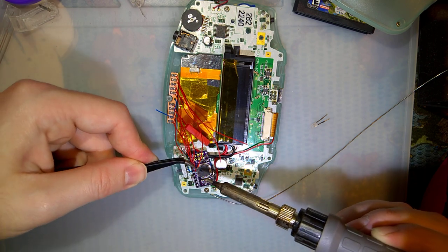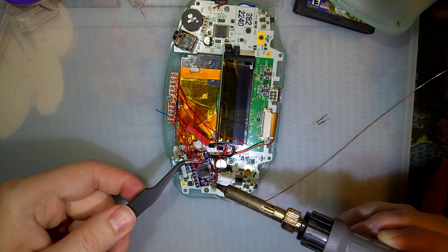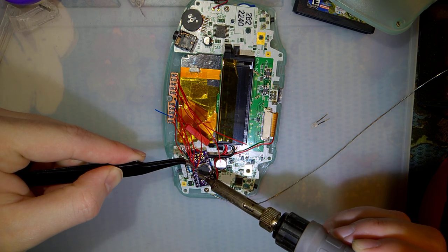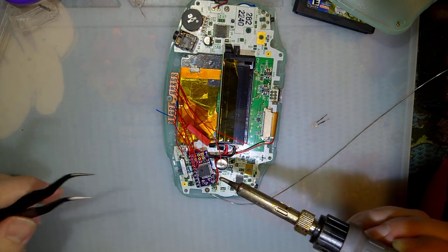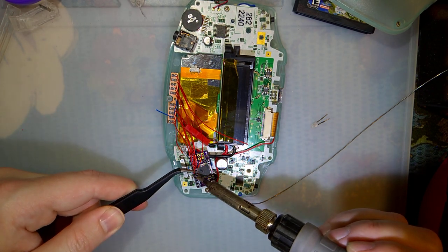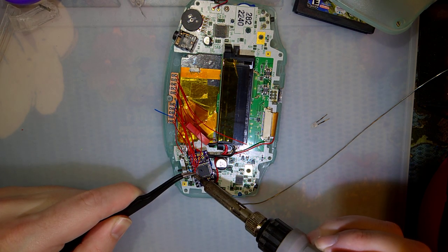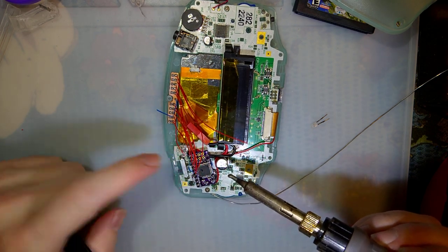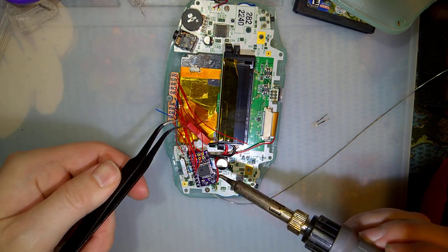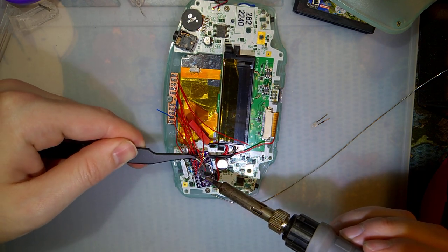I had a thought while I was getting these wires trimmed out. Instead of wiring this up 1-to-1, 2-to-2, etc., you could kind of mix up the wiring a little so that instead of a linear gauge, where depletion is left to right or whatever it is, it starts off by depleting the leftmost gauge and then the rightmost and then leftmost, and so on and so forth, till all you're left with is LEDs in the center. And then when those go out, you're completely out of battery.